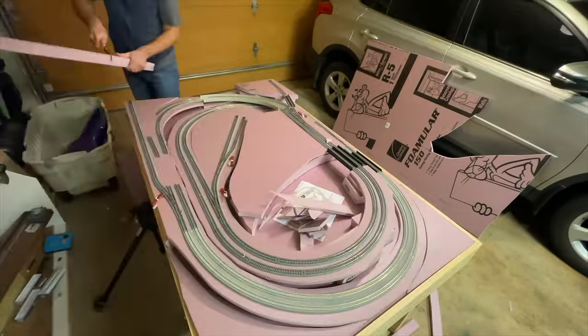While I don't have any lighting installed on the layout at this time, I went ahead and set up a 12-volt power supply, controls, and a couple terminal strips to make it easy to connect lighting later in the layout build process. I have a regular light switch with three toggle switches on it that you would just use in your house, typically on the wall, built into the layout fascia, and each of these buttons in turn can be set up to control one set of lights or other accessories.